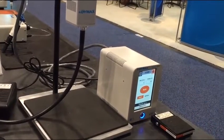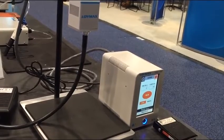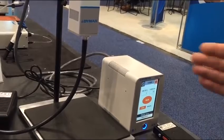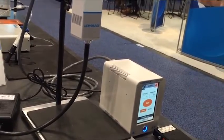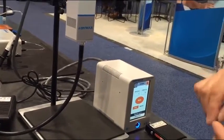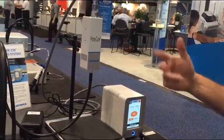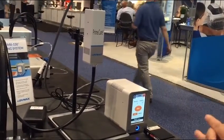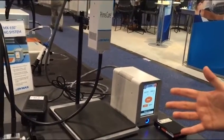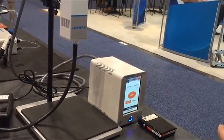The system also offers a very high intensity. Where some of our earlier units have intensities of 10 to 15 watts, this has intensities of between 30 and 40 watts. So you can pull the unit away from the work surface a little bit, and with the high intensity you can compensate for that and still get very quick cures for your products. So if you want something with a very high intensity and very quick cure, the MX150 is probably a good way to go.